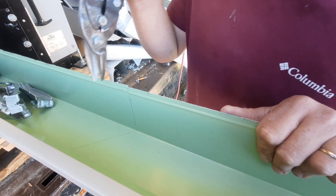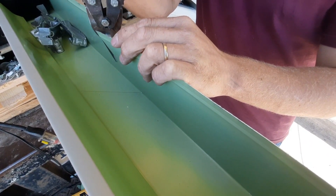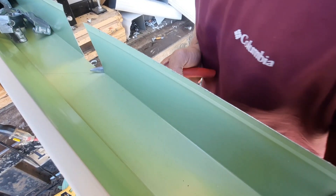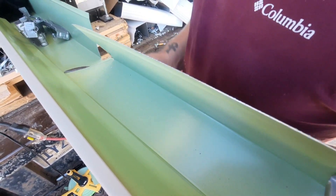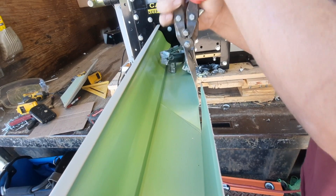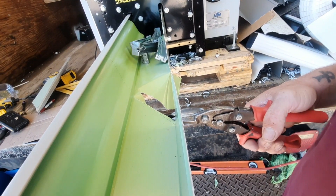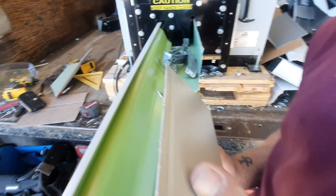Here's a trick for the outside miter slick. Cut straight down of course, snip this off. Then instead of cutting right on this line, bring it an eighth inch over, and you kind of cut back to that line as you go. Cut this a little bit more open. You get a little bit more meat there at the bottom just because this one's covering up that tab — that's just a little trick with that. Cut up on these lines on the slick, cut straight up there and then angle. We're good.